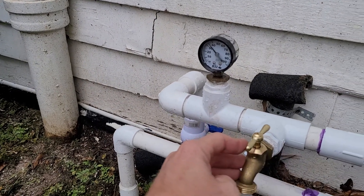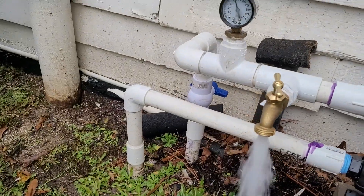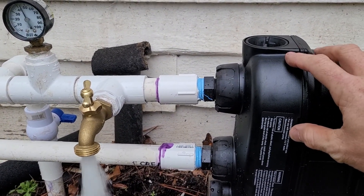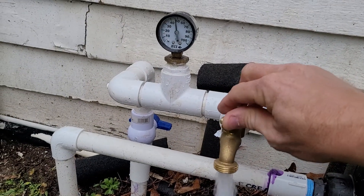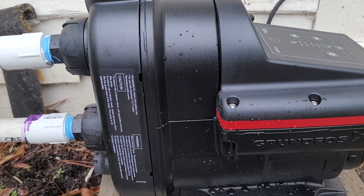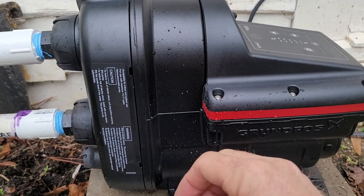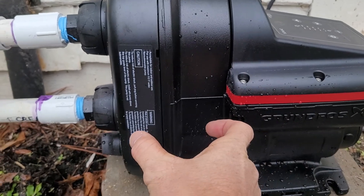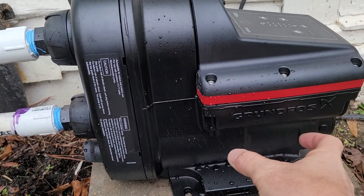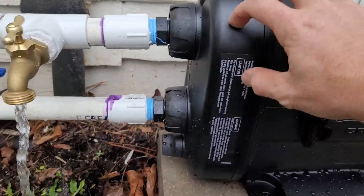As the demand increases, it maintains pressure. It has a little bladder tank built in here. It regulates — it tries to regulate the flow pressure by a variable speed drive, almost like a submersible pump motor. There's an impeller stack in here — it's got like four or five little stacks — and then the motor's back here. The little tank is right here, and this is where it's got the air inlet. It's all built into the plastic housing.